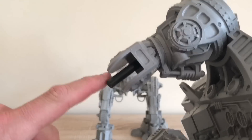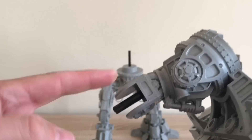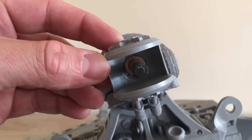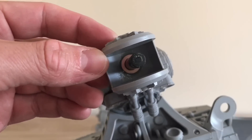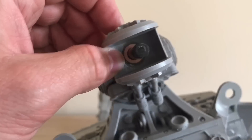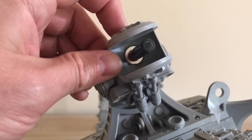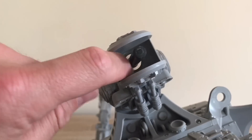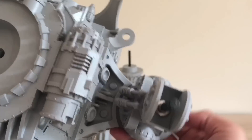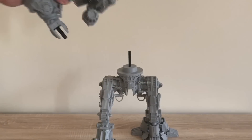What I did is I put this carbon fiber rod, which is 8mm thick, I drilled it into the shoulder, and then I beveled in a 30mm wide hole, and into that I put those donut magnets — really strong N52 grade donut magnets — so they've been epoxied in, there's two in each shoulder like that. And all stuck together extremely strong, so that's kind of like the innie bit.